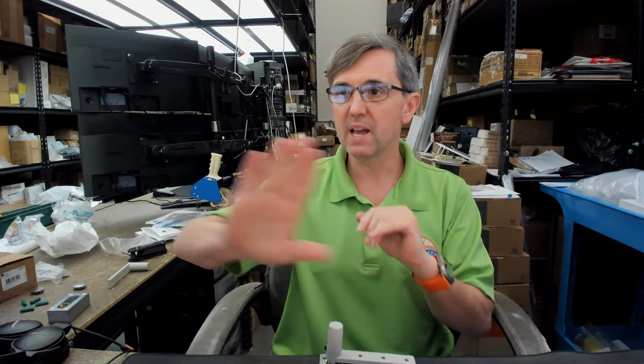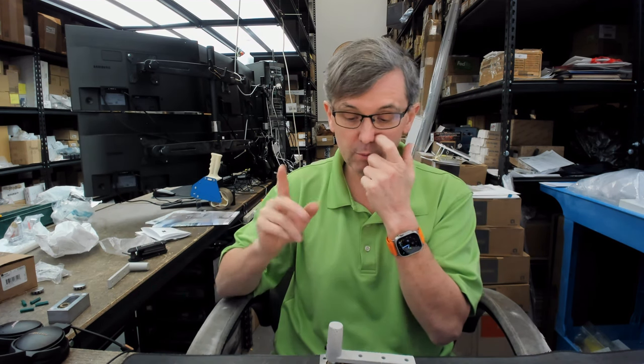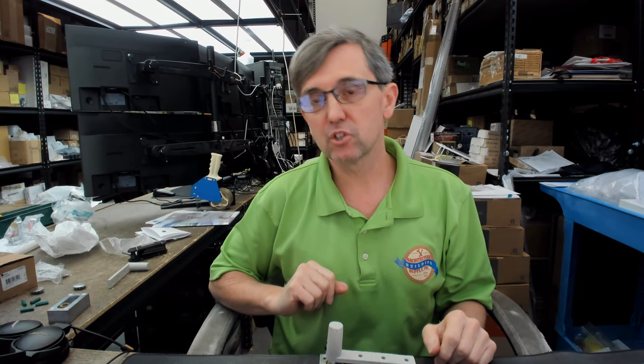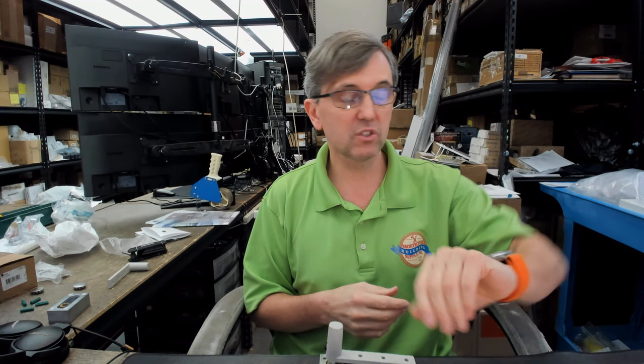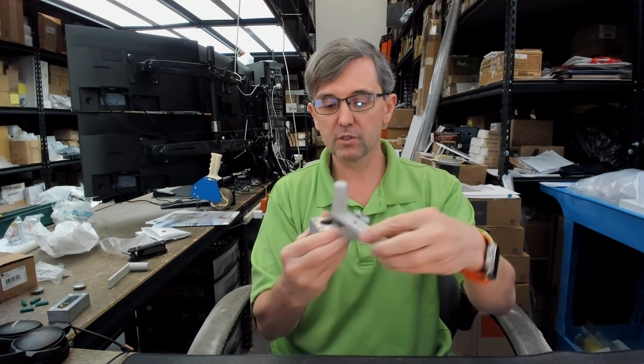It would be a very clean look to have a bank of doors that just have a 3/32 margin around everywhere, and you don't see any hardware. You don't see any hardware at all, and that would be pretty cool. You could even put touch latches. We've got heavy-duty touch latches, like $300 touch latches, and they will keep that full-size door closed, so you could have it. You can have a very beautiful continuous wall of woodwork, but it's all doors. Anyway, so that's where you're going to see this Hager item, this rack and pinion.